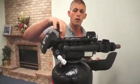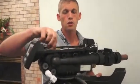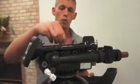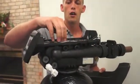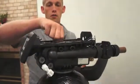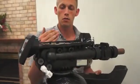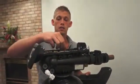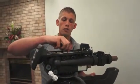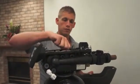You can start the screws by putting a few screws in individual holes. One thing I stress is don't tighten one screw down, then go to the next one. You can work it a little like tightening a tire. Work it from side to side, front to back, torquing things down slowly. Also, one trick if you're having trouble, because this is threading into a plastic valve, is to slightly thread the screw backwards first until it falls into place. Once you feel it fall into place, you can then tighten it down.